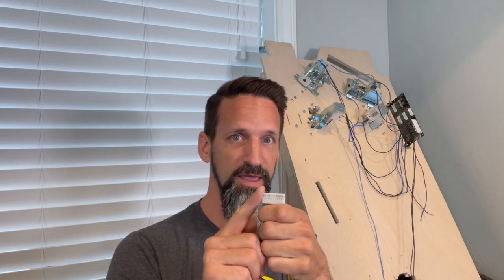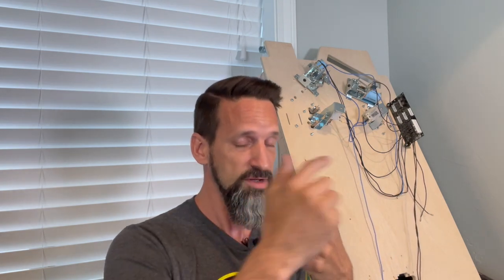And those wires need to also come up directly into here. And again, 0 through 7, so we're going to keep track of them and number them. My config file has all that for you, but keep track of them if you're doing your own. And then that gets plugged into the circuit board.